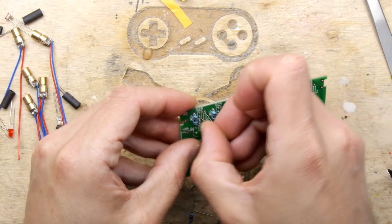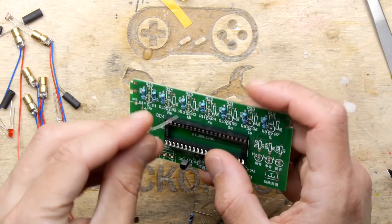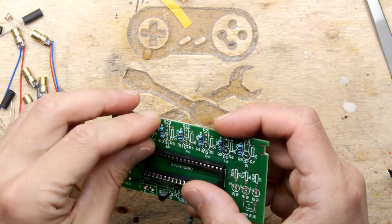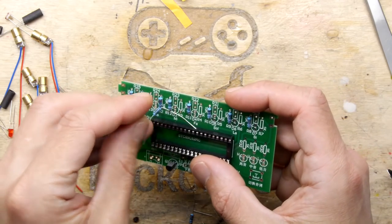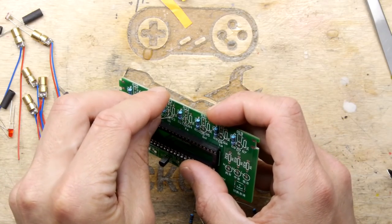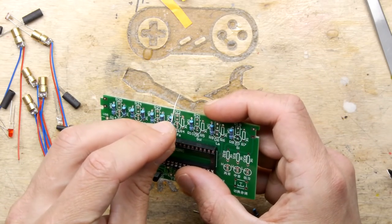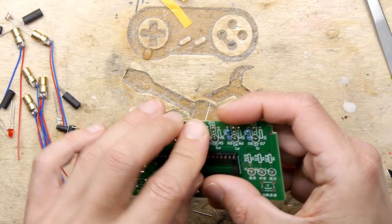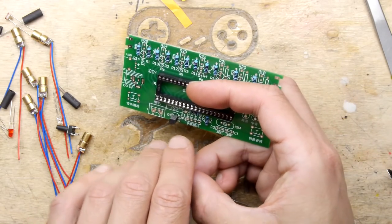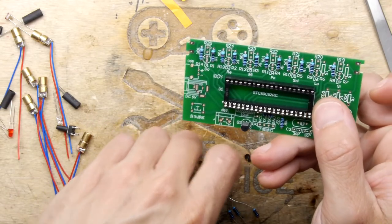Because there's that slightly fiddly mechanical issue with the LDRs, I'm going to probably leave those to last. I do have something actually in a box not too far away from me we can try. I do have some ceramic spacers, so let's see. If they're not too big, we could try putting a ceramic spacer on one of the legs of each one. If you've got anything like a bead, you know, little kiddie beads for their bracelets or whatever, even that might do. Just to get some sort of consistency. I'm looking at these heat shrinks that this came with, and each one sort of cut randomly. There's just no consistency in the factory on how long each one was. They just sort of go, yeah, that's close enough. Get the kit out the door.